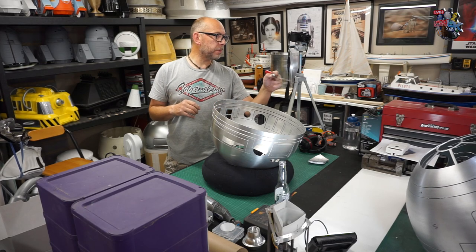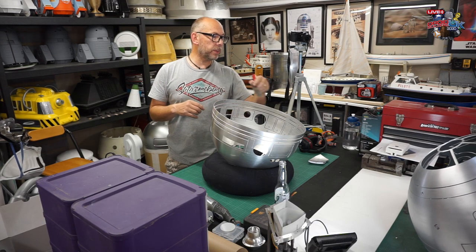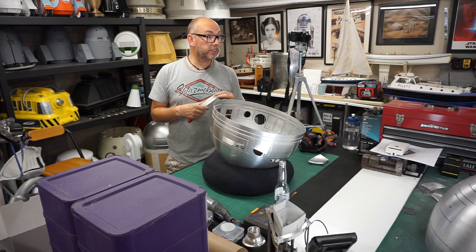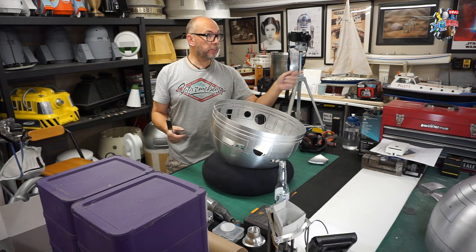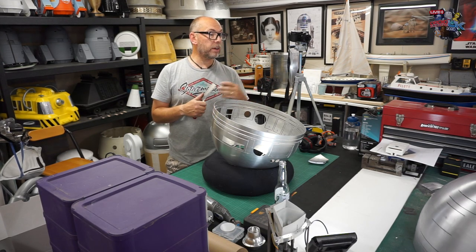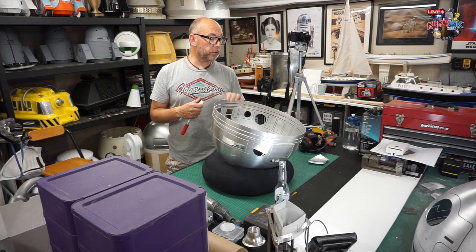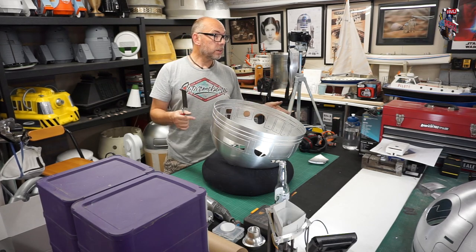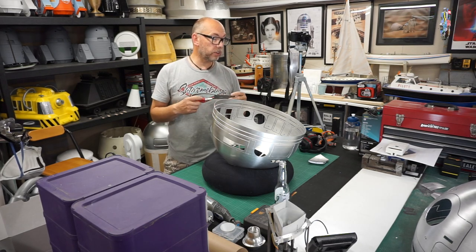And you can see a bit of the BB-8 design in them, that Jake Lunt style, if you like, with the eye and what have you. But yeah, I think it's really nice. A guy spent a few days cadding it up. We originally had just a clean aluminium dome that Jake actually drew the design onto. Then we took that to a guy to cad it up, and he took the measurements directly off the dome and came up with that. Then it's laser cut by the same people that do the R2 domes. And it's actually an R2 dome as well. It's the same profile, same diameter, exactly the same, apart from obviously the laser cutting design being different.